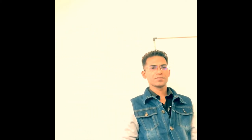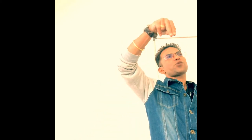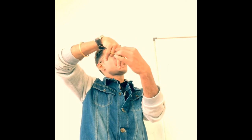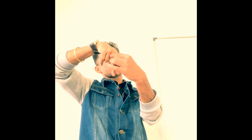The legs are made up of high carbon steel, and it can be sprung out or sprung in, so you can adjust this length. And it is made using spring steel, and the adjusting mechanism by which you can adjust it is made up of mild steel. How are they classified? They are classified by the length of their legs.